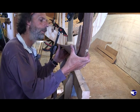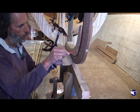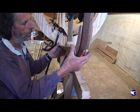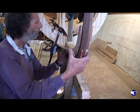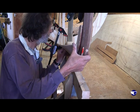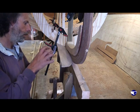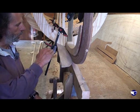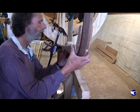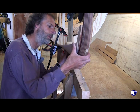We can see inside that we need to take more off up here, and gradually the whole thing will start fitting in. But we can't really afford to cut it exactly to this pattern, because when we steam the real plank in it's probably going to have more curvature on it — curved in every direction. This plywood is pretty stiff and doesn't really react the same way as a steamed plank does.